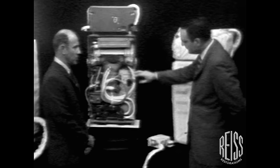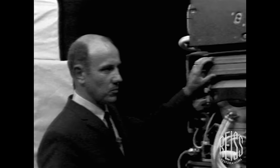Now, what does this machine do for the man walking on the moon? Well, in addition to providing the communications, the means for allowing him to talk to his fellow crewmen and to us back here, it provides a complete life support system, which provides oxygen within the suit, provides heat removal from his metabolic expenditure, provides for the removal of water vapor, which he gives off as he breathes, provides removal of carbon dioxide, which he also gives off, and it supplies the water from a central tank here to the sublimator, which is then boiled to the vacuum of space for this heat removal that I've mentioned.